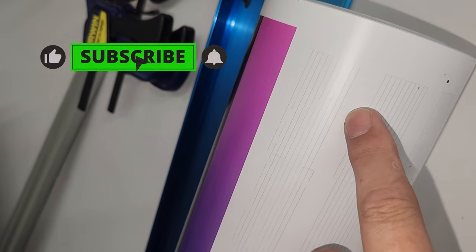This is when I was specifically having issues with mine where nozzles would start to drop out. So you can see the difference over in here where not all the nozzles are firing. This would be your black, this would be your cyan, and so that's a pretty good indication that something's going on there on one of the channels.